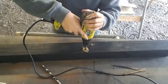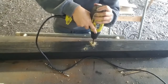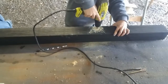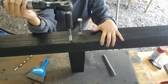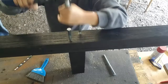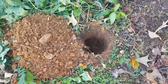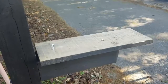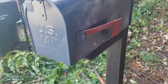The battery in my phone died and my husband finished drilling both posts off camera. He started by screwing the bolts through the tall post I had pre-drilled, into the back of the short post so he'd know where to pre-drill those holes. We used an air wrench to get the bolts in as far as we could, but because there wasn't enough power we wound up doing the rest by hand off camera. We used post hole diggers to dig our 12-inch hole, and you're also going to want to tamp the dirt and use concrete to stabilize. Once your post is in the ground, attach your board to your post centered as much as possible, then attach your mailbox to your board with the screws in the sides.